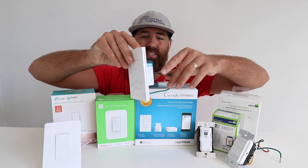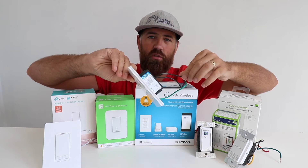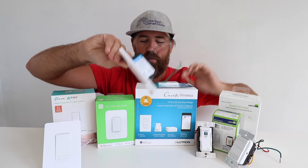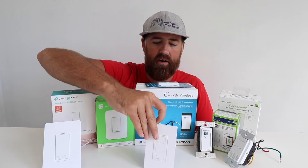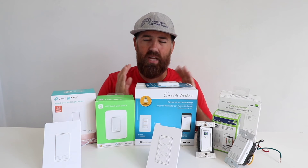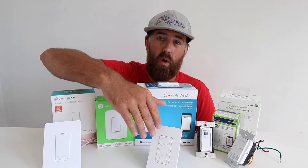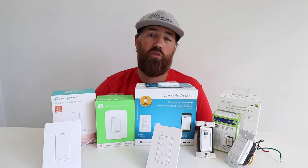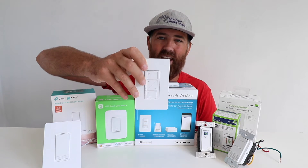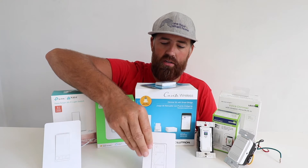What's also really nice about this is that it is bidirectional — you really can't screw this up. You take out your old switch, install it with the new wires; your hot wire and your load wire can either one be reversed and this goes right in. So it's less wiring than some of these other light switches. The only downside is that it does require that hub, which has a device limitation of about 75 devices. The Lutron Caseta switches work in three-way configurations, there are on-off switches, and this is a Lutron Caseta dimmer with on and off at the top, dimming controls in the middle, and an LED dimmer indicator on the side showing the current dimming level.